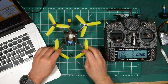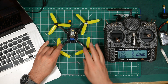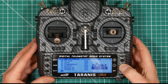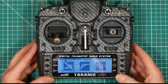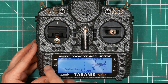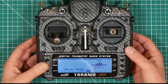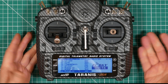So now we need to get our ViFly 150 connected up to our transmitter. The first thing we need to do is create a model on our transmitter — find an empty slot, press enter and create model. Now scroll across to quad. I've already set up the defaults on my radio so that the channel assignment can just be done by hitting page. Long press to confirm and we now have our new model.